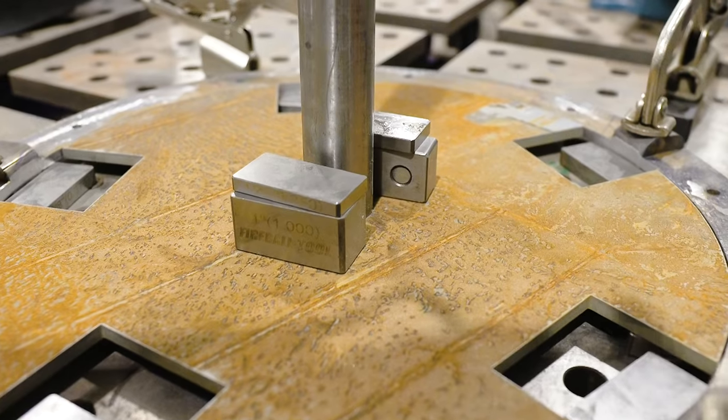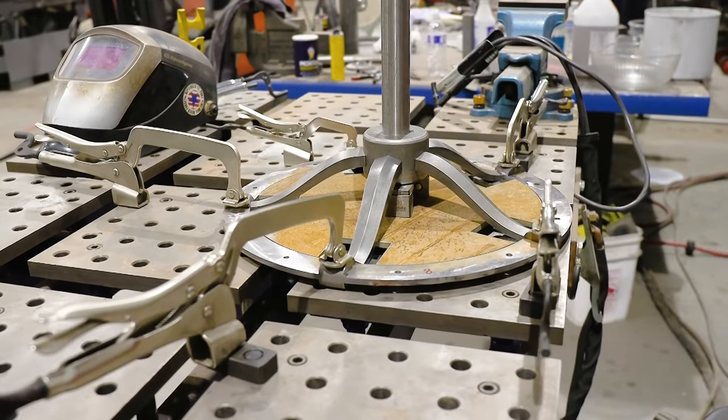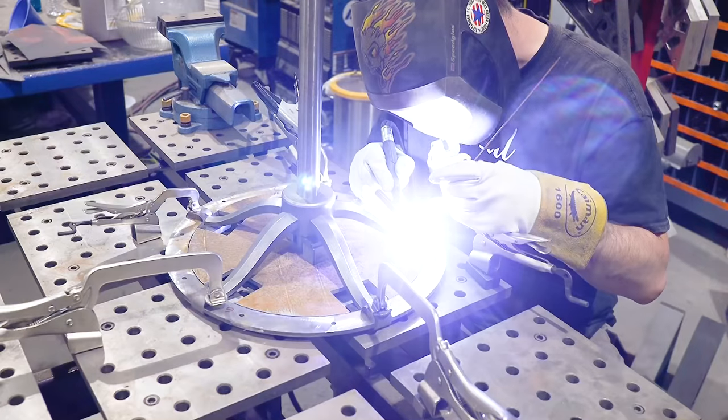The hub's at the correct height because we have magnetic shims that are varying thickness. If you guys don't know what magnetic shims are, I'll put a link in the description below. So everything's held in place, it's at the correct height, it's secure, it's time to weld.